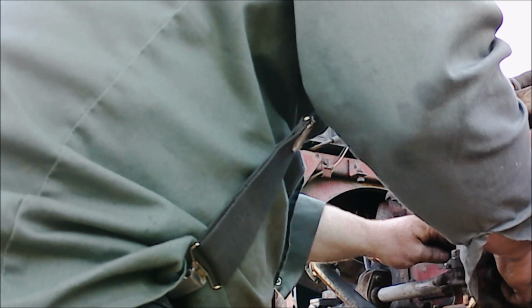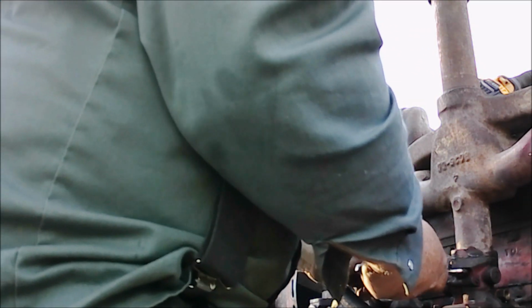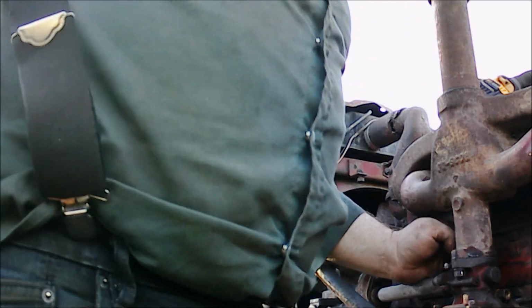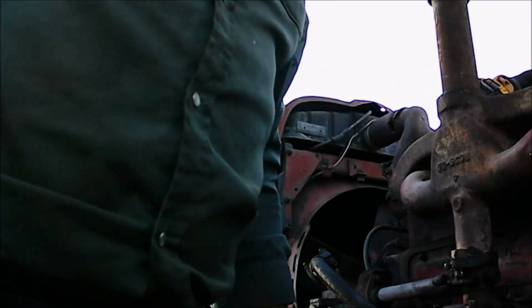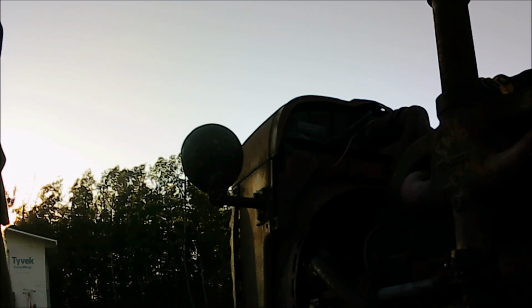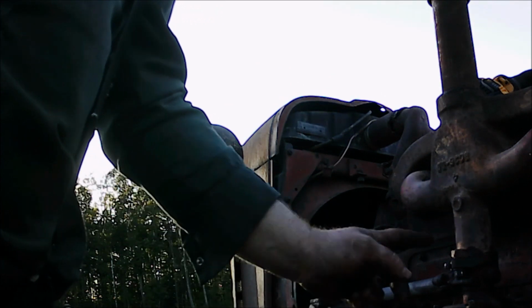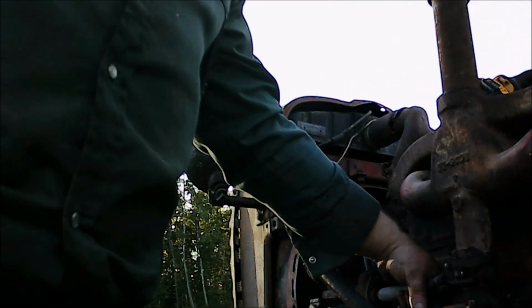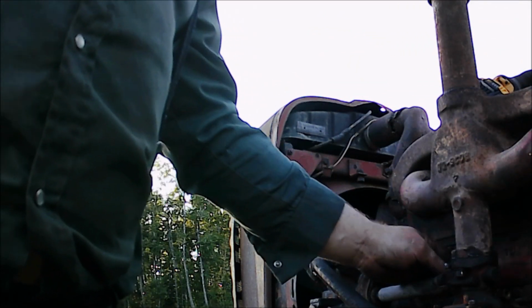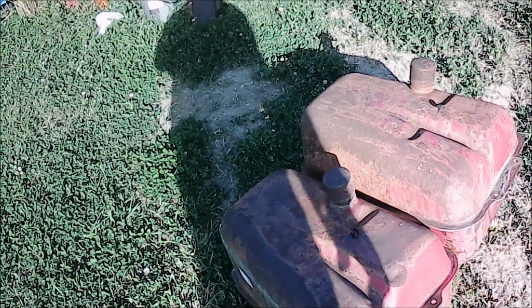They are a bit of a nightmare for sure. I'm going to get a crowfoot wrench and make sure this is tight. If these are not tight enough and it leaks vacuum, you're going to have a world of trouble with this. Hard time starting it for sure. And then you could suck in dust and dust the engine, but this side of the carburetor, good luck with it.